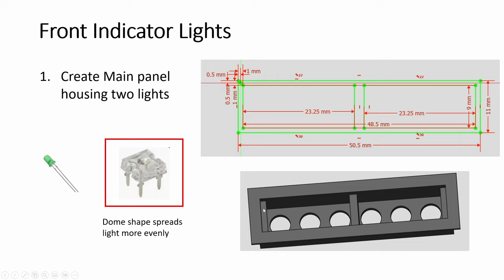This is only about half a mm or 1mm on the side. You don't even need it on the sides — just the two ends like this. Then the 3mm thick light panel just goes on top. I started with directional LEDs — these are quite bright too — but the dome-shaped ones are even brighter. The best part about this dome-shaped thing is it spreads at a wide angle, so the text is more evenly lit up. These are called Piranha or Flux LEDs. All these are dirt cheap — a bag of 20 or 50 for a few bucks.